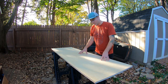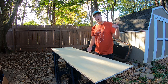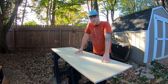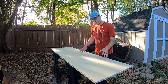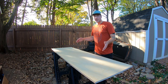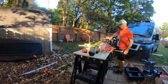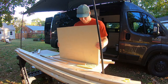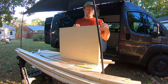I am going to use uprights out of plywood, basically the same way we did it with our lower kitchen cabinet, and then do some stick framing in between kind of like we did with the face frames on that. I'm going to cut four uprights and then see about fitting framing members in between and on top. Got our four uprights — they are 24 inches deep and 20 inches tall.